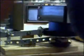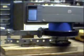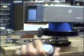Now we're going to take the stator magnet off the backing plate and rerun the same tests without any interaction. This just literally holds itself on the backing plate because it's so damn strong. Sliding it off is quite difficult. Okay, there we go. There's very little magnetic attraction and repulsion to the backing plate, and whatever I add on one side will subtract on the other, so I don't believe we're going to greatly affect the results of this test by just having it that way. So here we go.